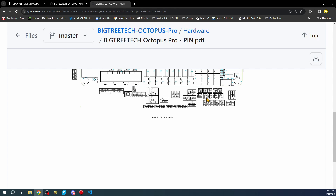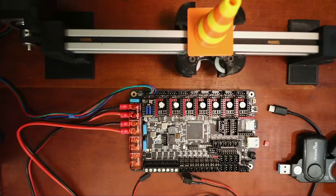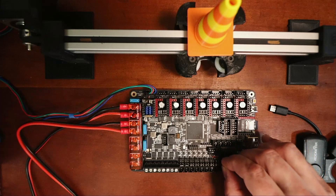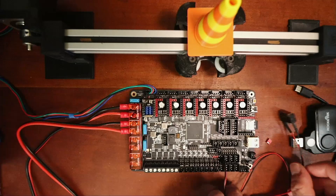So PG6 is the pin I was referring to - difficult to see but it's right there. That's a lot of work to get this set up, but now you know what I'm making reference to. I have the endstop here and we know that the PG6 pin and the ground pin are here, so we're going to connect like so.